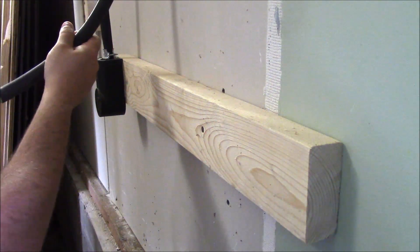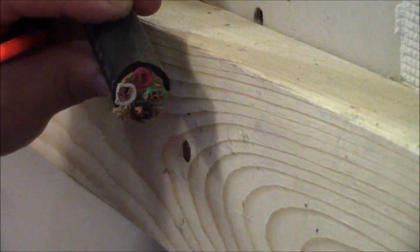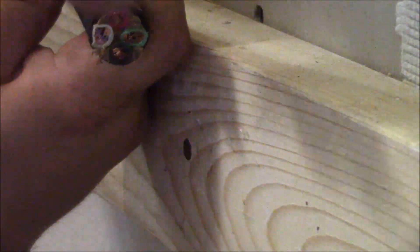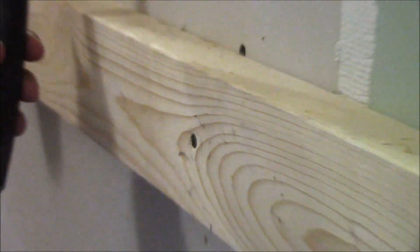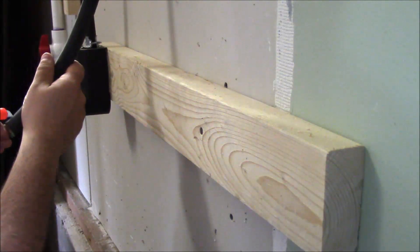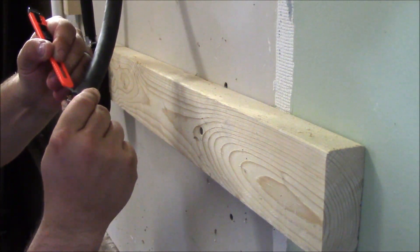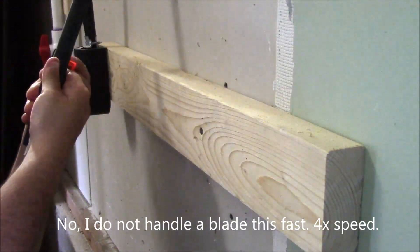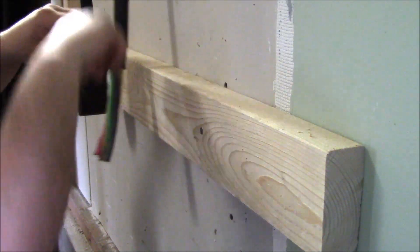I'm going to take the cutter and make the first cut. Inside this wire we've got little pieces of cardboard surrounding the other insulated wires. I'm basically going to make my incision over top of that cardboard so that I know I'm not messing up the insulation on the wire. One thing to be careful of — this wire is actually twisted, so you have to do a helix path if you're going to try and stay over the cardboard. Trim away all the extra cardboard.